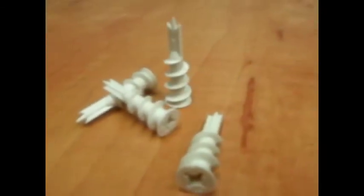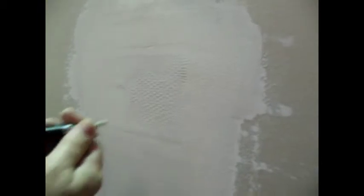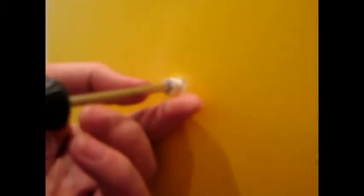This is a plastic drywall anchor, great for securing pictures and heavy objects to the wall. Should the circumstance arise where an anchor is attempted to be inserted into an area that was repaired with a wall patch, the damage will reveal itself and most likely increase in size — the plastic anchor cannot penetrate the metal screen. Inserting an anchor into an area where the drywall plug is used has no effect on the damaged area. The area can be used as if it had never been damaged before.